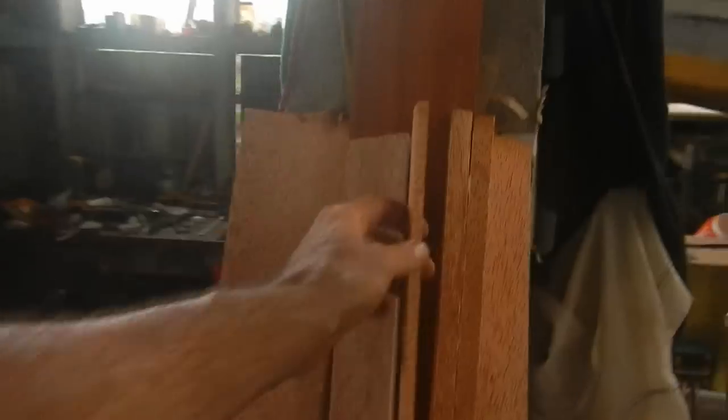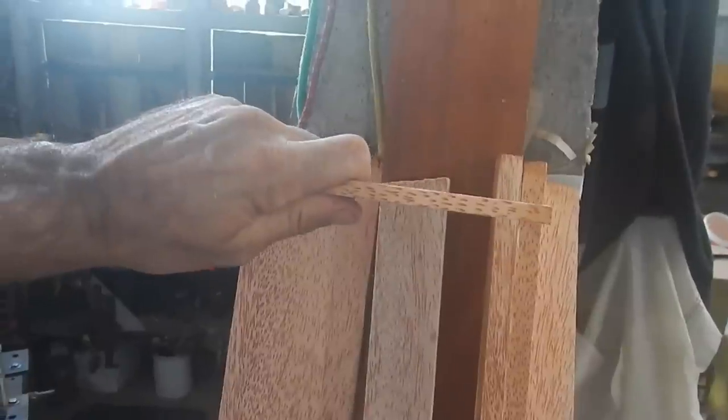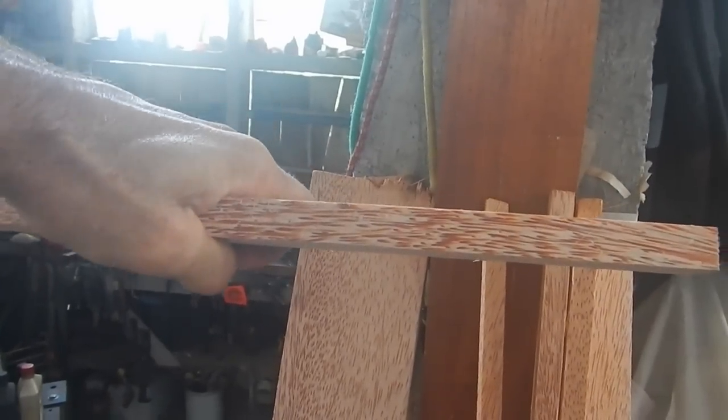The up and down is already very well measured because there's a wheel on the side that raises and lowers the whole thing. And that wheel has spokes on it. And I clip something to the spokes. So, for instance, if I do a cut and then move down two spokes, I get this thickness. And then if I move down four spokes, that was this. I'm pretty sure that one was a four spoke. And I think I just did two and four spokes.